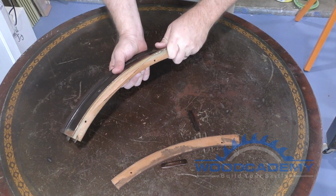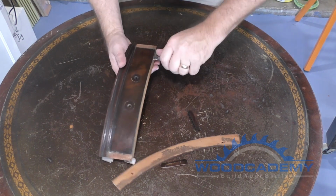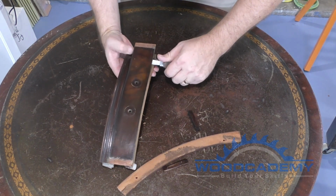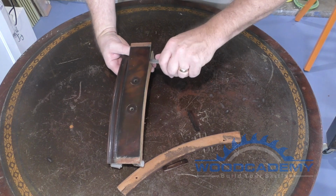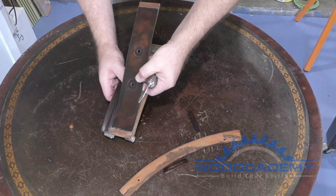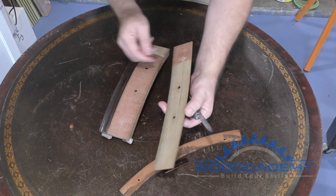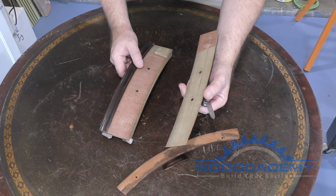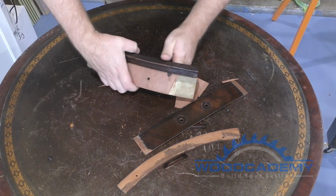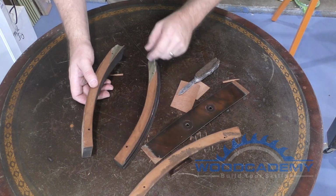The main body of the apron turned out not to be mahogany, but rather veneer applied over poplar. No surprise here, this has been a common method for building since the 1800s. The mahogany burl veneer was backed by a cross-grained mahogany layer, and both of those were bonded onto the poplar core. Like the top, the bottom was also a piece of molded solid mahogany, a little bit thicker and with more molded detail.